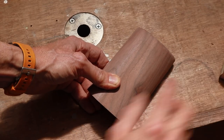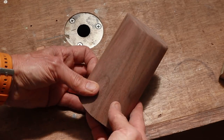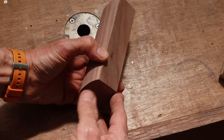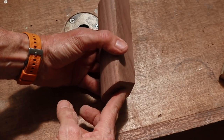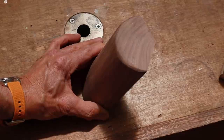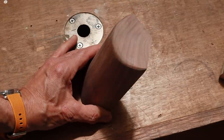For the fore end of the coaming, where the starboard and the port meet, I fashioned a walnut block using the same 130 degrees and 19 degrees on the bottom here, so that it will sit in there to hold where the two coamings will come together like that.